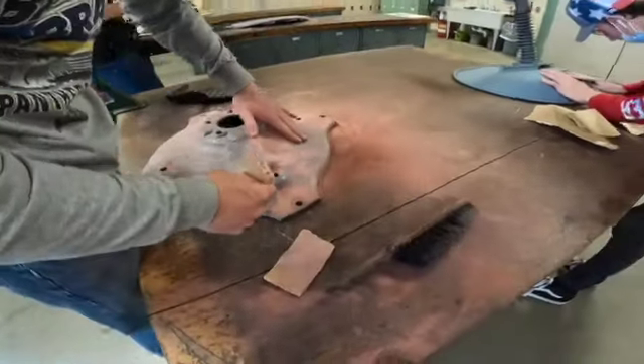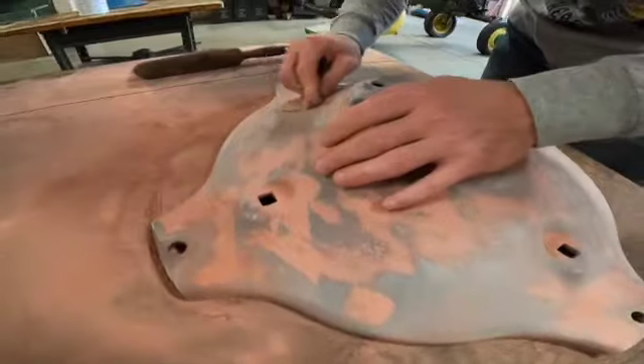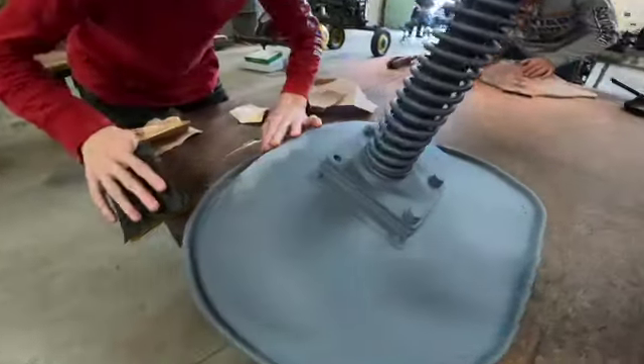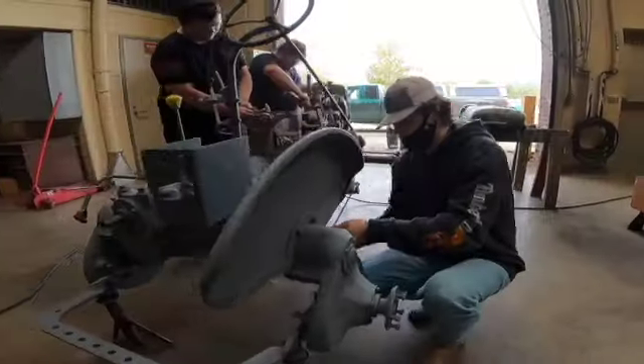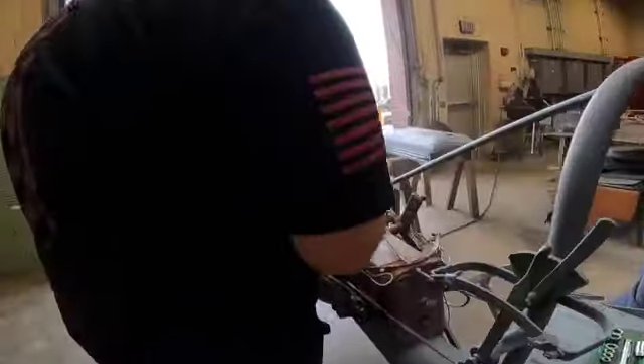This video shows a glimpse of all the work that was put into this project by the students, work that included lots of bodywork. Body filler was used on various components of the tractor to fix the imperfections that were visible. We prepped the tractor for paint by using wire wheels to strip the body of paint and get it down to bare metal.